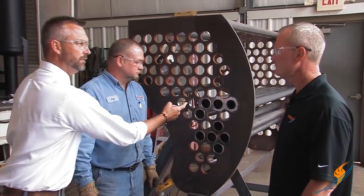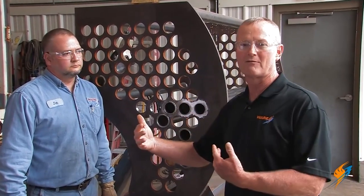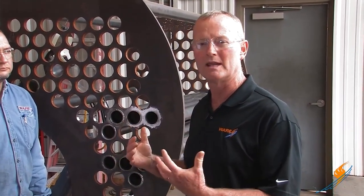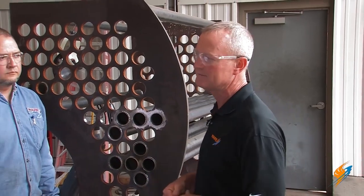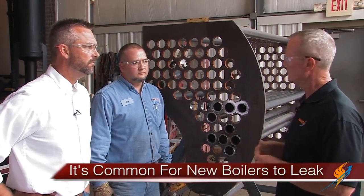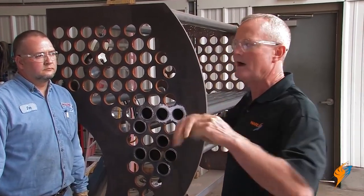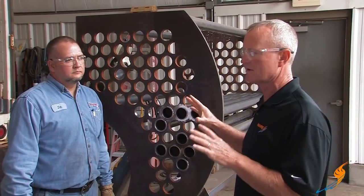Can you actually roll a tube too much? Yes, you can. If you roll it too much, you'll thin that tube out, and if somebody further down the road needs to re-roll it — say the boiler was scaled up, overheated, and the tube was pulled a little loose from the tube sheet — they won't be able to re-roll it. They'll have to cut the tube out and put a new one in. It's also common for a brand new boiler to arrive leaking — in transit they get shaken up. Once you fire it the first time, everything swells and the tubes stretch, but you may still need to snug a few up just a little bit.